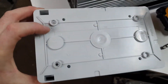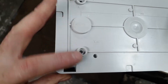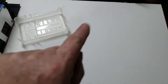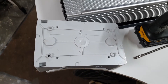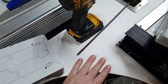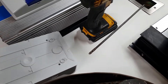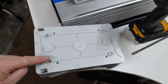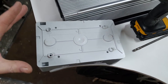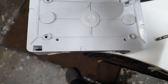There are two blank mounting holes and I'm drilling a little pilot hole in them so when I mount it I can position the little grommets to give me my shock absorbers. With the white panel attached to the body of the vehicle, any vibrations would come straight through if components were mounted directly, but the grommets give us an extra level of shock absorption. I'll just drill a couple of holes here.